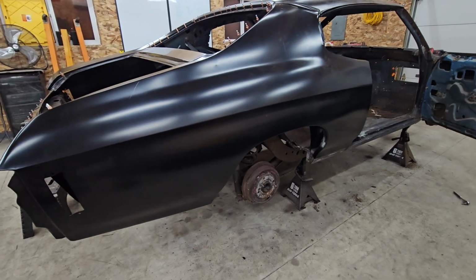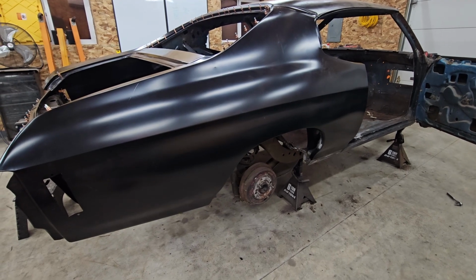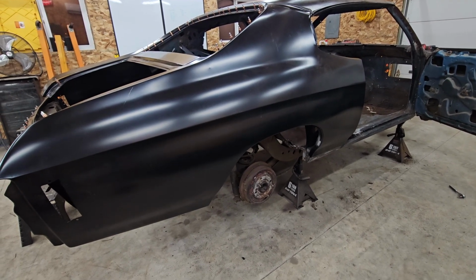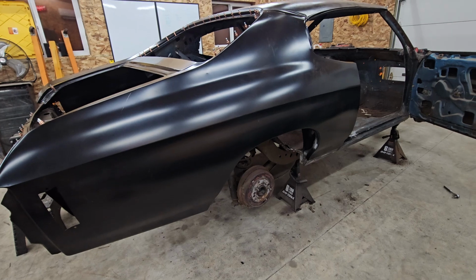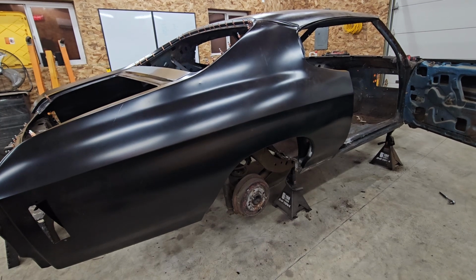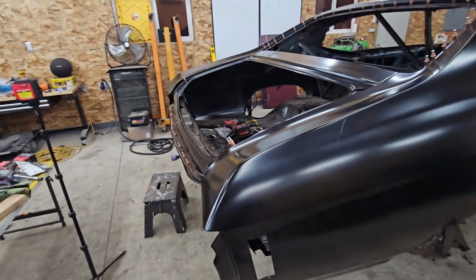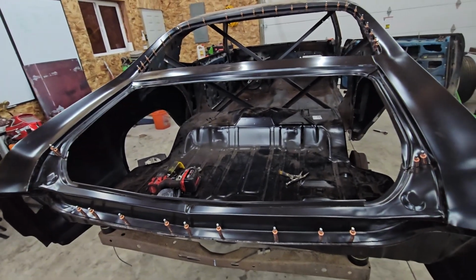So I think tire-wise, I'm going to go with the 345/30/20. Hopefully, my plans for this car change, so maybe the vision will change in time, but I'm not thinking so. However, overall size of that tire is 28 tall and 14 wide. My goal is to stick out. Now, I don't want to leave it just sticking out, so I'm going to have to figure out either I go Trans Am racing style with fender flares, or I go Rocket Bunny style with my own custom fiberglass quarters, front fenders. I don't know. It's a lot of work. I'm a long way from there. I'm just a dreamer who constantly thinks of crap and then wishes I had the money to do it.